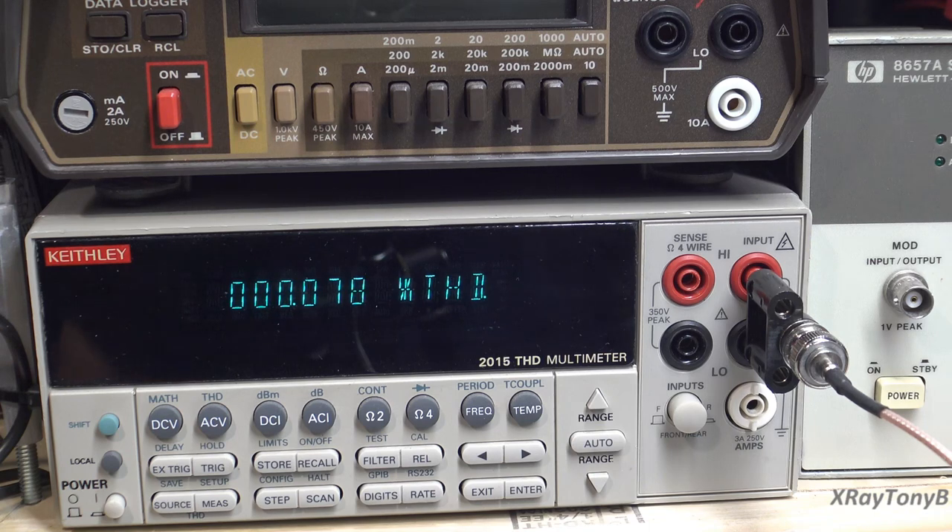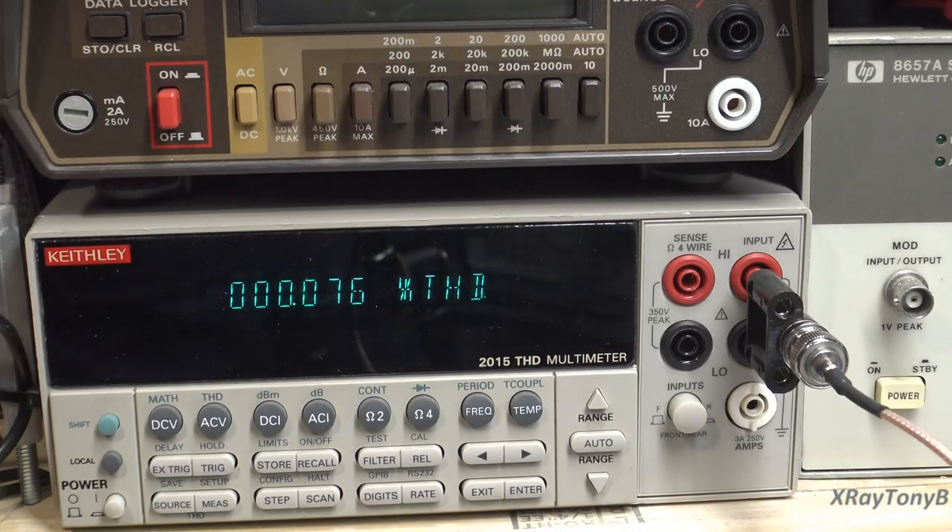Now they say you can go into L205 and fine-tune even more to minimize the distortion. But I can tell you right now it's already set. If we play around with it, you can see the THD starts to climb up very quickly — and sitting at the null point, there it is. So yeah, it was set. I'm pretty confident this thing's going to be pretty low distortion. So anybody who tells you an FM receiver can't give you very low distortion — it can. The bigger problem is things within your radio: you have to have a very strong, clear radio signal and no multipath distortion.